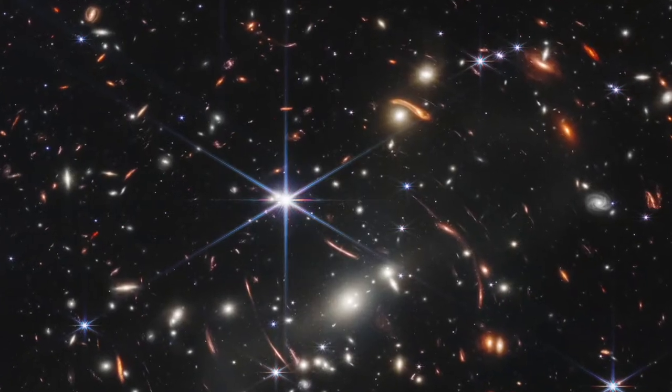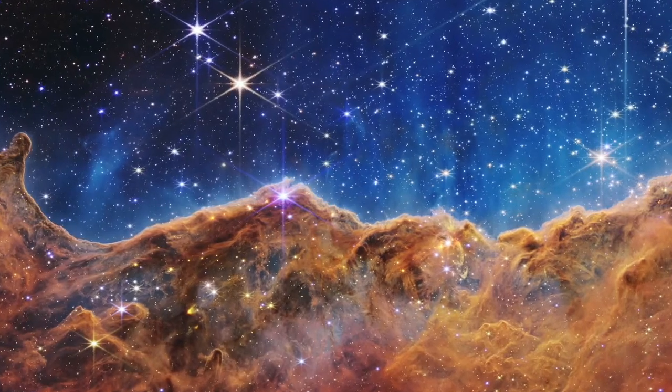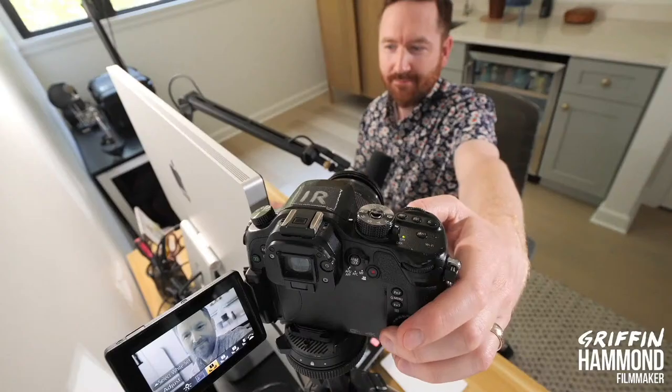Hey, indie filmmakers, I'm Griffin Hammond, and today I am streaming outside the visible light spectrum in near infrared using my IR modified Lumix GH4 camera. It's shooting at 720 nanometers, a spectrum not that far off from what the NIRCam on the James Webb Space Telescope is capturing. We'll talk about the kind of photos that this camera can take and what kind of interesting artifacts come with infrared photography.